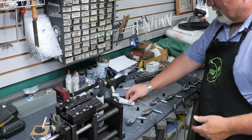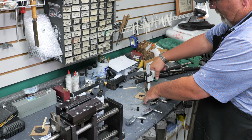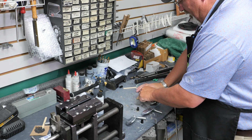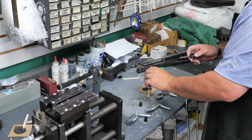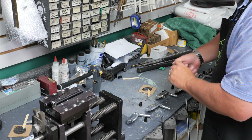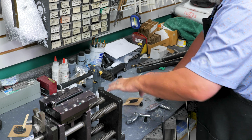However, what we're going to be using is this, so I can show you. And this is my 420, a little bit, so you can gauge how much you want to pull out or push out. Then we're going to stir this for about 40 seconds. The idea of stirring it is that we've got to ensure that it's mixed up. At this point, I'm putting in what's called quick center, Black Beauty sandblasting beads. They don't want to be real big, and you don't need a whole bunch. Then we're going to mix that in. Okay, so a little bit over a minute. We've got it all sitting there, and there we go.